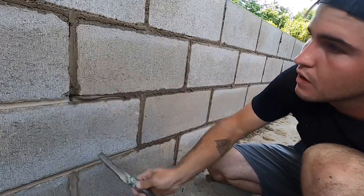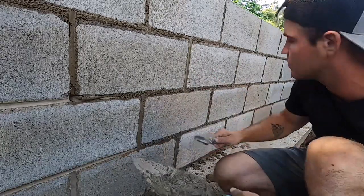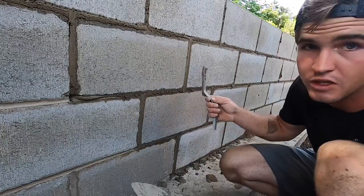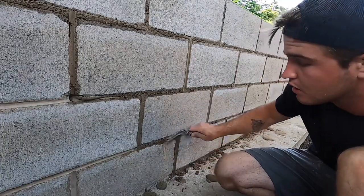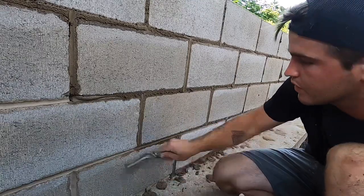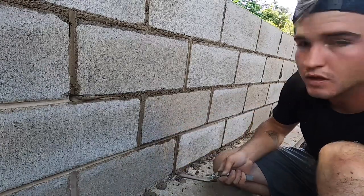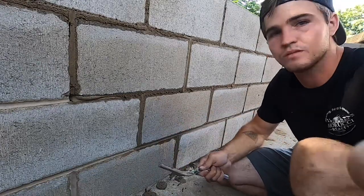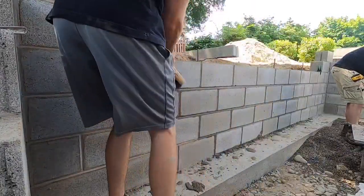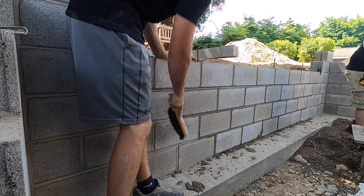All right. Just so I don't waste your time here, I'm just gonna do a couple so you can see. So you do all the heads, pretend I did them all, all right? Then you come back and do the beds. Again, you are only riding with this part. You see where it's building up? Ride there. Looks good. That's it. When you're done with that, you gotta brush it. Once you do them heads and the beds, you run through, brush that thing off, make sure there's no holes. Do that all the way across.